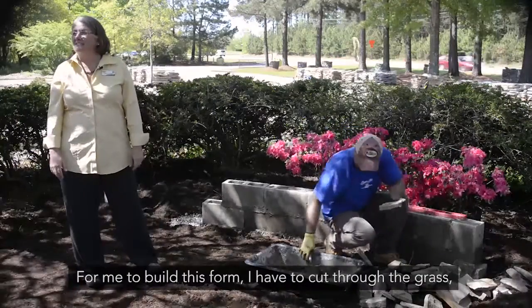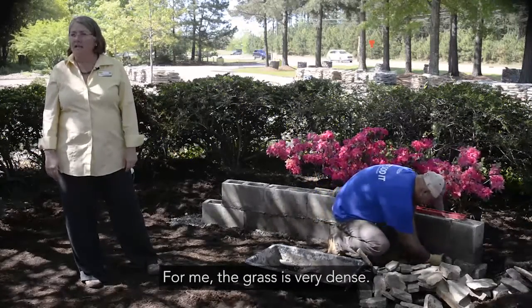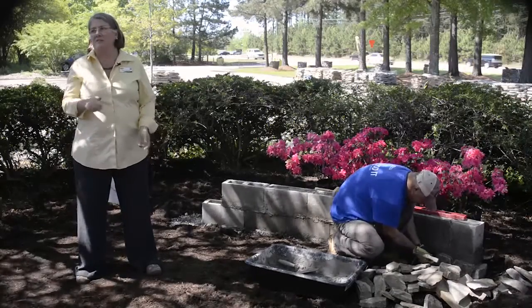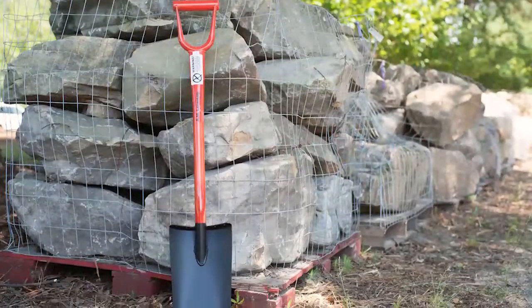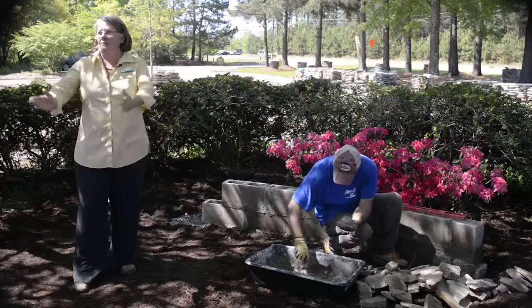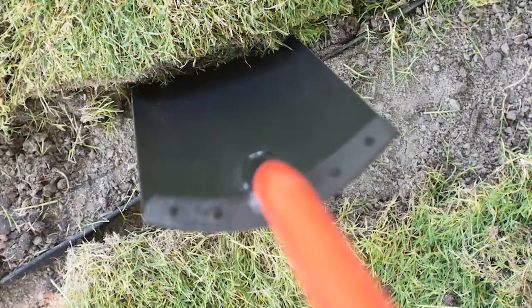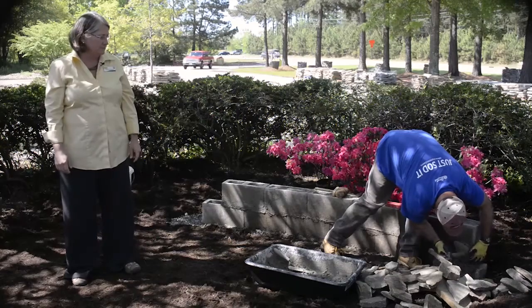Question about cutting through grass before building a wall: the best tool is a spade with a very tapered, long, straight edge — what we used to call 'la pala azul,' the big blue shovel. The big heavy ones that are all one integrated piece, about 50 to 60 pounds, do the work for you. Instead of a little shovel where you're working at it all the time, those big heavy spades will go right through solid ground one-handed.